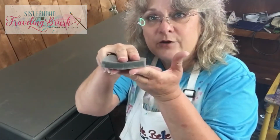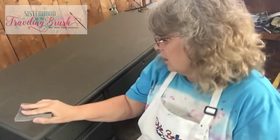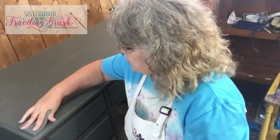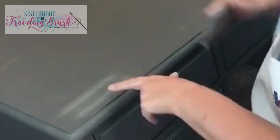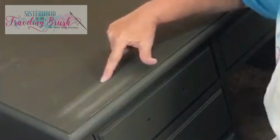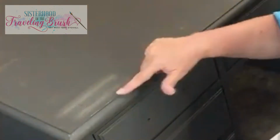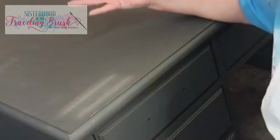One other thing to think about is how you place your hand on your sander. If I grab it like this to hold it so that it's secure, it's gonna have pressure marks from these two fingers. See if I can do that. See how, definitely can see from there. There's where one finger was at, there's where another finger was at. This isn't sanded enough. So that's gonna create a whole another problem for me.